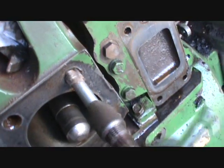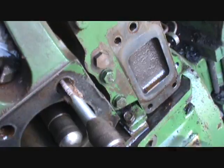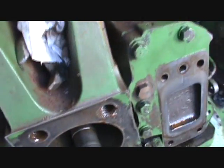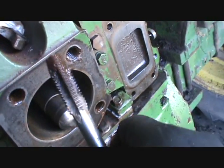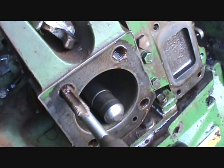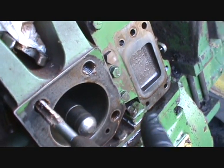I'm just chasing out the hole so that when I put the piston and all back in there I don't have any binding issues from the rust. I've thrown some liquid wrench in there to help clean it out — that works pretty good. Some of you guys were talking about PB Blaster — I've used it, there's nothing wrong with it, but if I'm trying to loosen up nuts and bolts, it's usually an oxygen-acetylene torch because it just works faster.